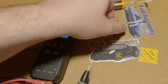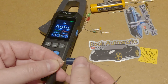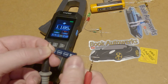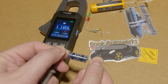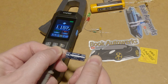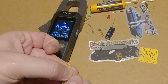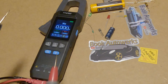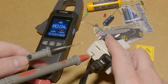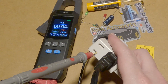We'll switch over to capacitance. Capacitance is kind of a funny thing with meters like this — it depends on the type and size of the capacitor how accurate they are. Reading 1.1 millifarads, kind of around 1.18 millifarads — this is supposed to be a 1000-microfarad capacitor, so yes, that works out if you do the math. This little ceramic one is reading about 1 microfarad. For frequency, the meter picks up the 60 Hz line voltage without even needing the neutral probe in — perfect.